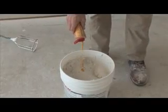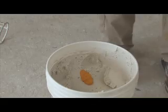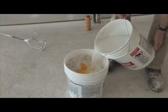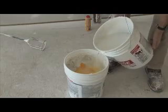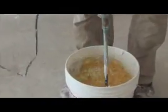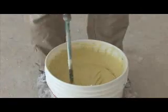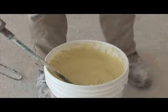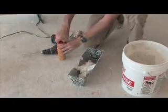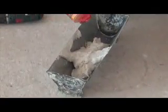Mixing in the Never Miss coloring gel is easy. For larger batches, add about one ounce to a five gallon bucket of compound. Add water to thin compound as desired. Never Miss has been tested and approved by major joint compound manufacturers and will not void warranties. Thoroughly mix in the coloring gel, which is available in both yellow and blue. Smaller batches can be mixed in a pan — add a few drops of Never Miss and stir it up.